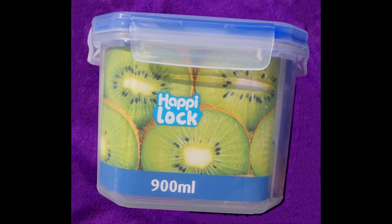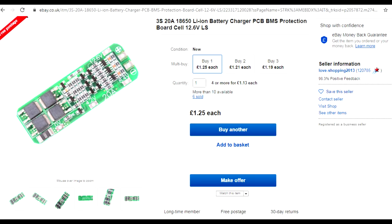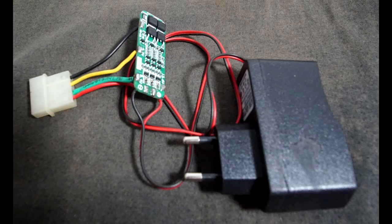You can see the insides quite clearly through it. The circuit runs quite happily off 12 volts. I used three 18650 lithium cells in series, which is around 12 volts. I built a BMS charger for it using ready-made modules from eBay. It is really not worth designing and building your own BMS and lithium battery charger — they are so cheap from China, they're now a commodity item.